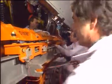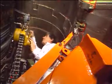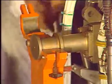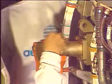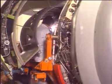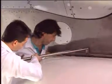Disconnect the engine cradle from the trolley, and raise the cradle to the engine using the 4 chain pulley blocks. When the cradle reaches the engine handling points, secure the supports on the front and on the rear parts. Loosen and remove the bolts of the forward mount, then the bolts of the aft mount through an access provided when the hinge access panel is removed.